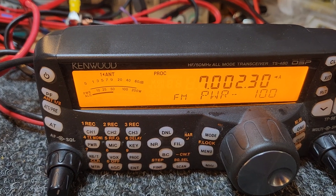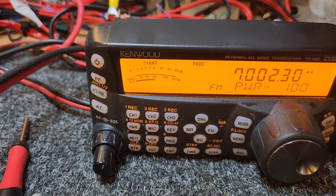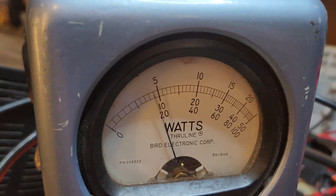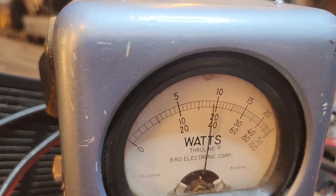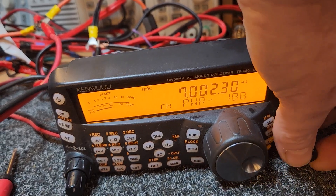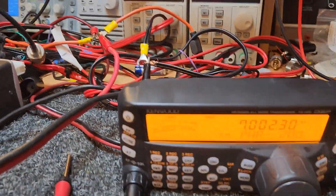I really should bring that other supply. Let's just see where the current starts to cut in — I reckon at 150 watts will be fine. Yeah, just starting to sense the current capabilities there, drawing about 25 amps here. That's when my supply starts to show its weakness, unfortunately. Because we then go up and, yeah — if I turn that up, that's a problem.